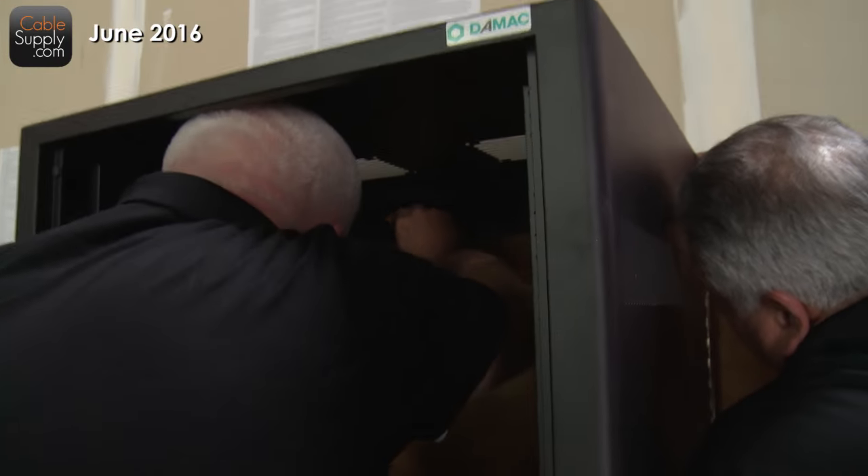This gives you a lot of flexibility — a lot of things you can do with this little panel. You can run 110 to the cabinet. If you're going to use 110 in the cabinet, make sure you ground it. You can bring your low-voltage cable in from the top and power from the bottom — whatever you want to do. Everything can be attached here.